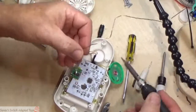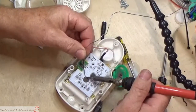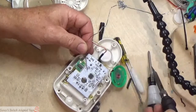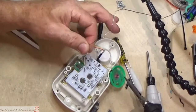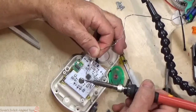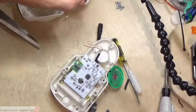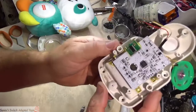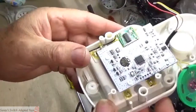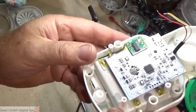Having done that, let's see if my soldering iron is warmed up. We all know that wires stick better to circuit boards if they have been tinned, so we're going to warm that up and tin a little solder on the board — just the smallest dot — making sure it doesn't bridge over the two connections on the board. Then we're going to tin on the other side and inspect it. We need to make sure the solder we just put on did not accidentally cross and short circuit the board.